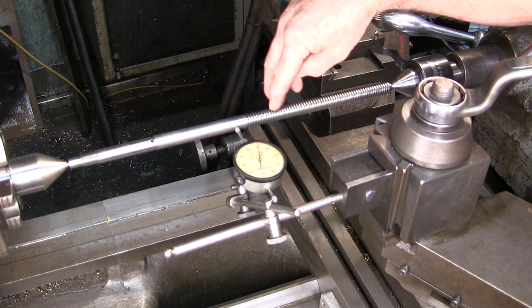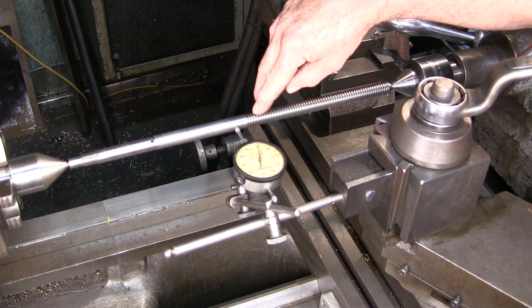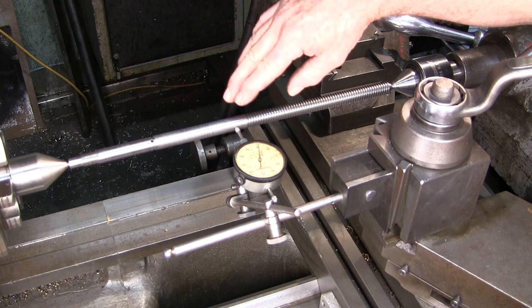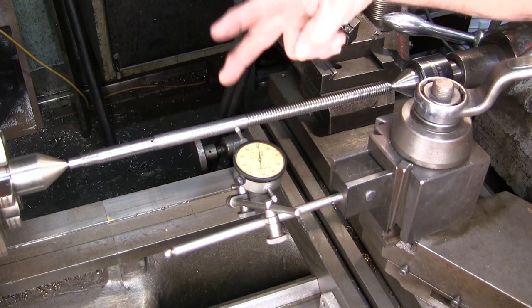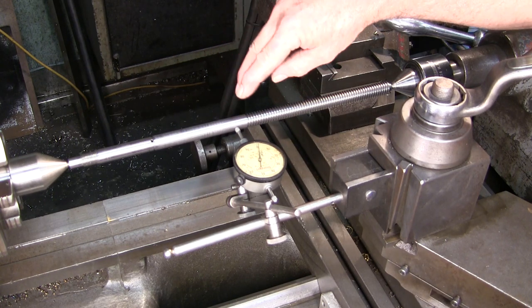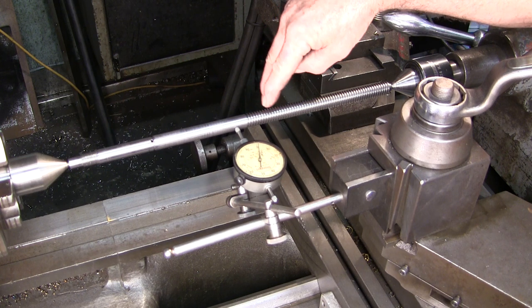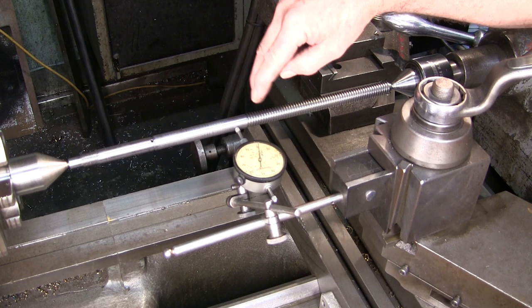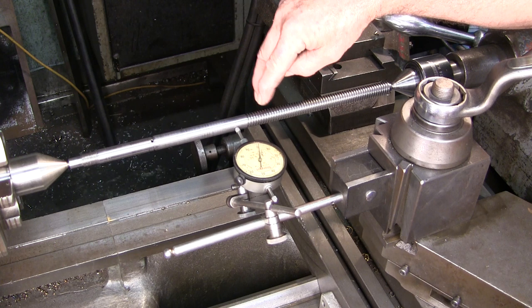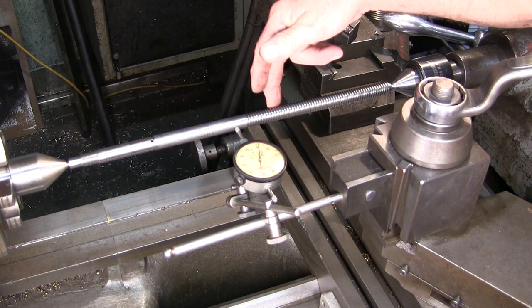We don't know how this got bent — it was bent when we took it apart, of course we didn't know how bad it was until we put it in here. We had about 25 thousandths and then got it down to about 15. I started working over here putting it in the arbor press, hitting it by hand — just thunking a little bit. You couldn't even really push on it without going past where you wanted to. It really is an easy-bending little shaft. We're going to be cutting a new lead screw and cross feed screw in the Rutland lathe.